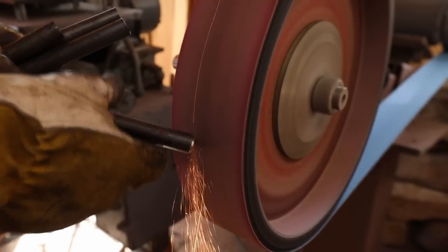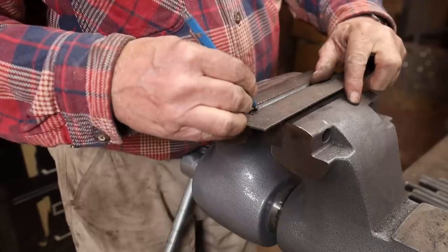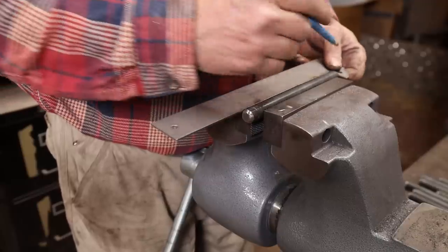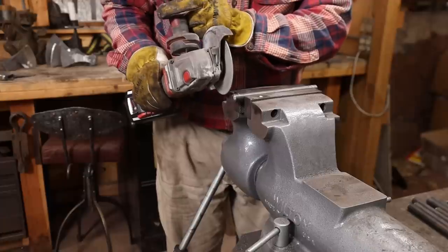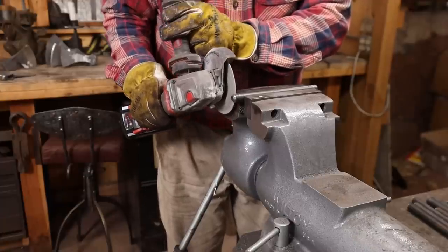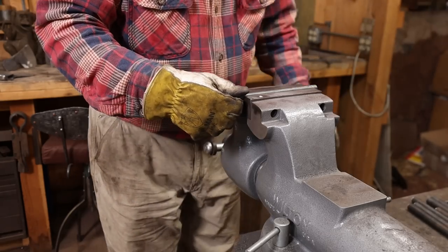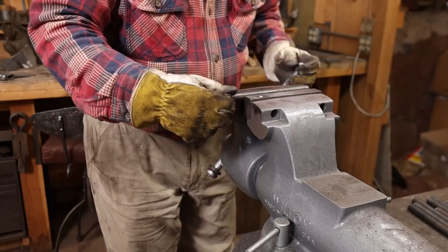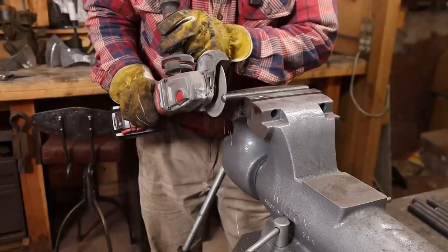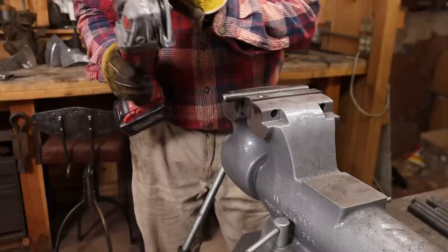So you take 8 of these and 16 tenons to get this assembled. I'm going to come in 1/2 inch from each end and put just a little bit of a groove in with an angle grinder. That will give me a good reference point that I'll be able to catch with my butcher tools and make sure I get all of these exactly the same. That leaves me just a little bit long in between. That'll be 6 1/2 inches in between. And then I will upset the tenons back with a monkey tool to get a good shoulder, and that should give me my extra 1/4 inch. In the end, the most important thing is that all eight bars are exactly the same length.